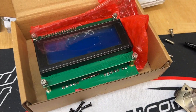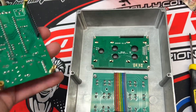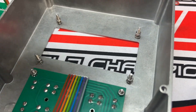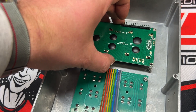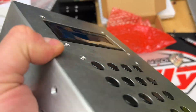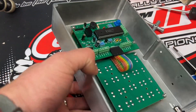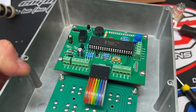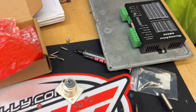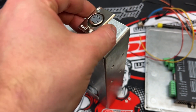Let's get on now to mounting the controller board and the screen. The control board came attached to the screen. I've just taken a little bit of time to make sure I've double-screwed these to stand them off to the right height, so that when this is screwed down it'll be flush with the overlay. So that's where we're up to — we've got the keypad in, the module and LCD screen in, the buttons, and the stepper driver mounted.